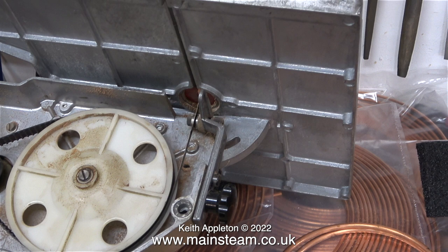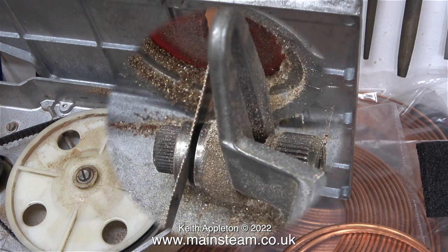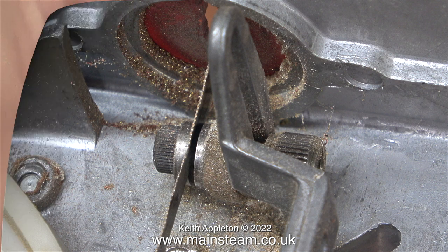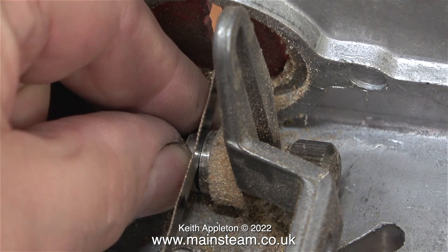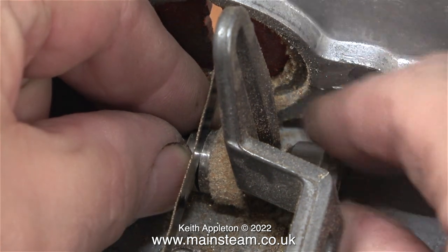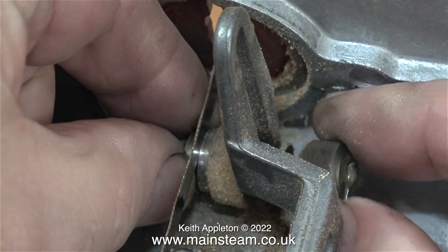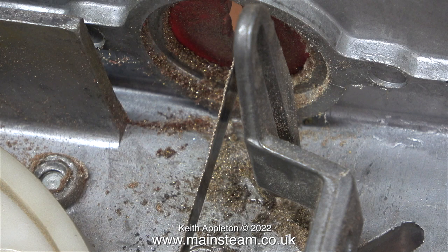It was pointless showing the original top blade guide because it had fallen into two pieces. The guide underneath is a very hard piece of steel with two very hard pieces of steel as washers which guide the blade, and the problem is the very hard piece of steel has worn all the way through on the top one so there's none of it left. I could copy this part exactly and fit a version of it to the top of the machine, but I've decided not to do that.